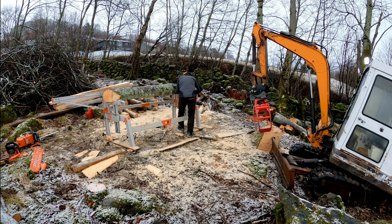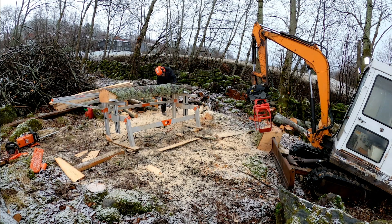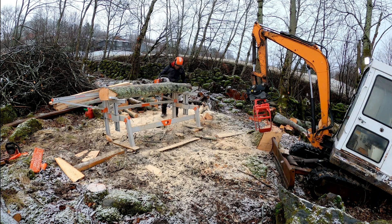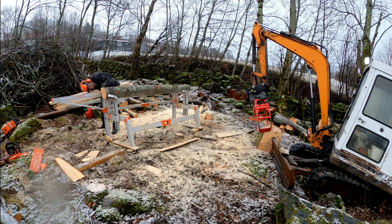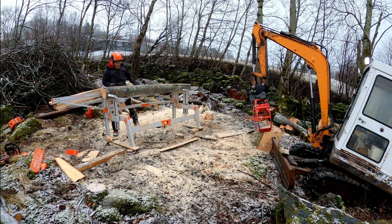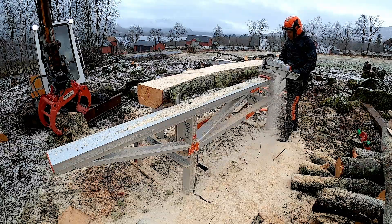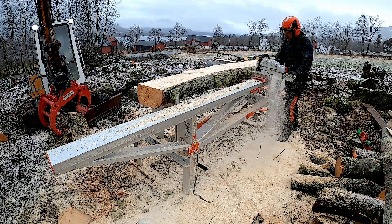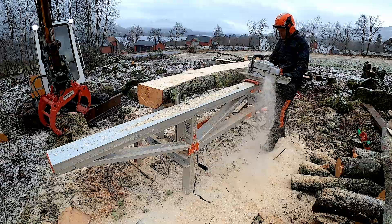The log I'm milling here is a bit crooked, so I decided to just mill small slabs instead of lumber. One of the things that takes a little getting used to is estimating how much to take off in the first pass when you have logs that are not very straight. I ended up taking either a little too little or too much off the log, so I tried to be conservative and do multiple passes. Controlling the height is quite easy with the log lifters — they snap into place and you can instantly read off the height, so it's quite easy to get consistent thicknesses. Here you can see the speed of the milling process; the saw has milled up quite a few logs before I took this shot, so it's actually quite dull.